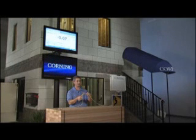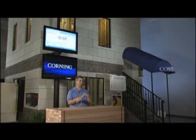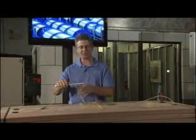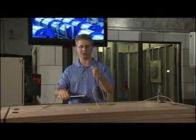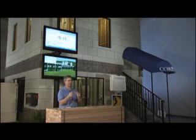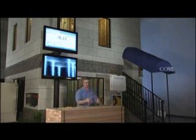This is typical of what you'd see in a multi-dwelling unit — equivalent to about 40 to 60 ninety-degree bends from where the fiber starts to where it terminates at the subscriber. This is a wonderful solution for MDU applications and anywhere a drop cable might get pinched or bent. It's still not completely foolproof — an installer could potentially bend it tighter than intended, which leads us to our third sample.